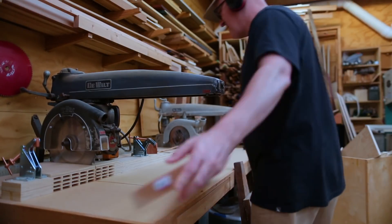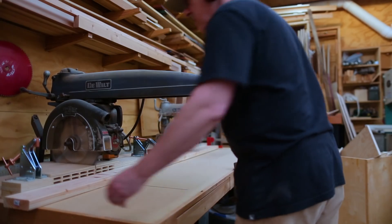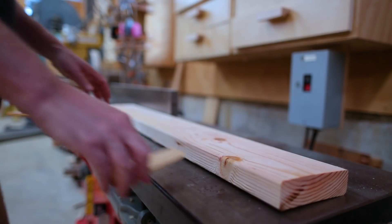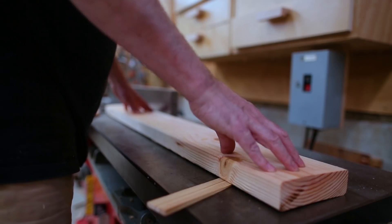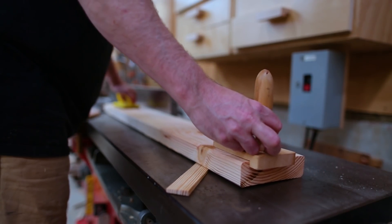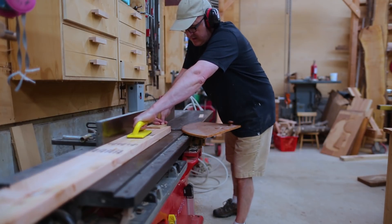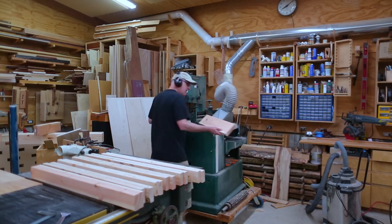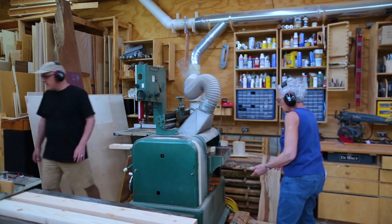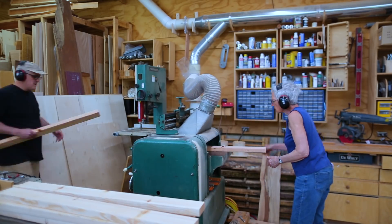We decided to make it out of simple two-by material, as this won't necessarily last very long, it's not very expensive, and it's easy to work with. So I was back to jointing and planing two-by material. I figured I'd use two-by-sixes for the two arches and legs and cut up two-by-fours for the cross pieces. I got that ready by lightly jointing and planing. It really helps to have someone else catch the pieces as they come out of the planer, so I had my mom help — it's more than twice as fast.